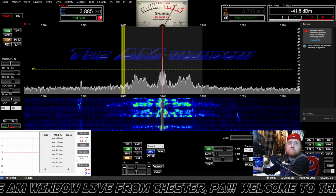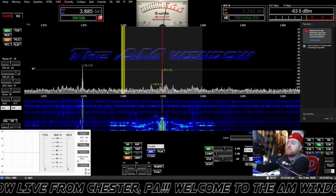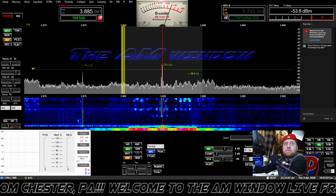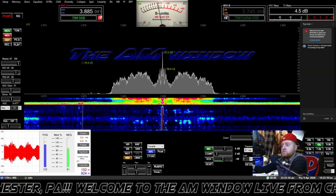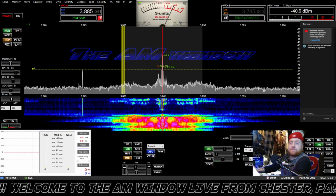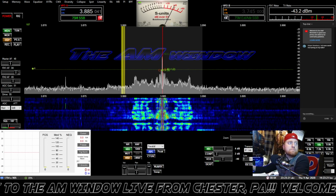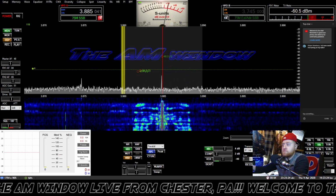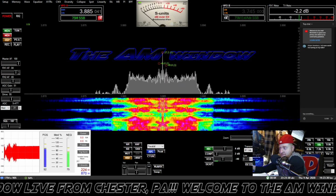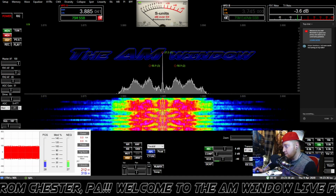I may try and convert the filaments on this thing over to DC or something. That's a 2KD? No, it's a 2KX, as in X-ray. A 2KX? I don't think I've ever heard of a 2KX. It's the export model. It has 11 meters in it, and it's got a 4,500 watt plate supply. Yeah, I got the AL80BX, the export version. It came with 10 meters and a little beefier power supply. It came wired for 220 from the factory.